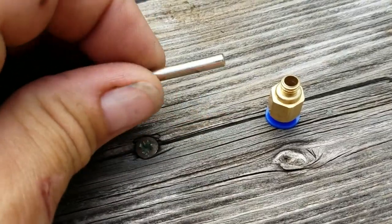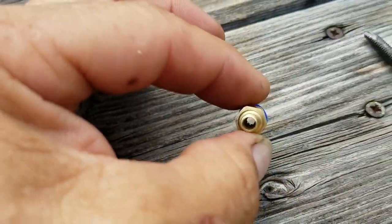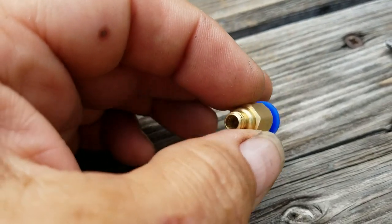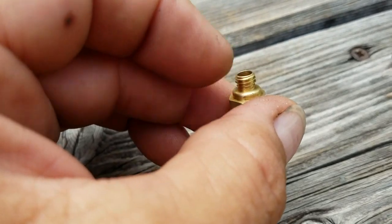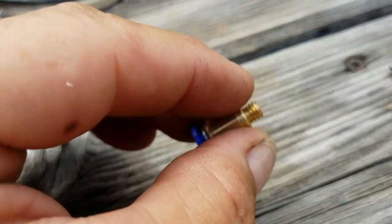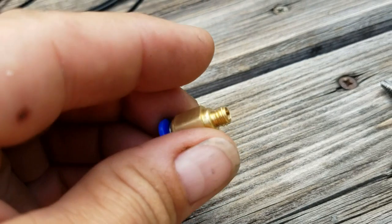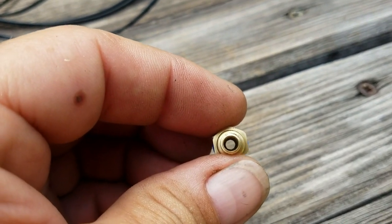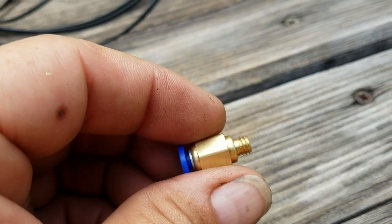One thing to note — this is a 4mm temperature sensor and a 4mm pneumatic connector which has an O-ring seal in it. What I had to do is drill the back end down to the O-ring to ensure that the sensor can go all the way through rather than come up against a stop. You've just got to be careful with that because the drill can grab and damage the O-ring, but I managed to do it quite satisfactorily.